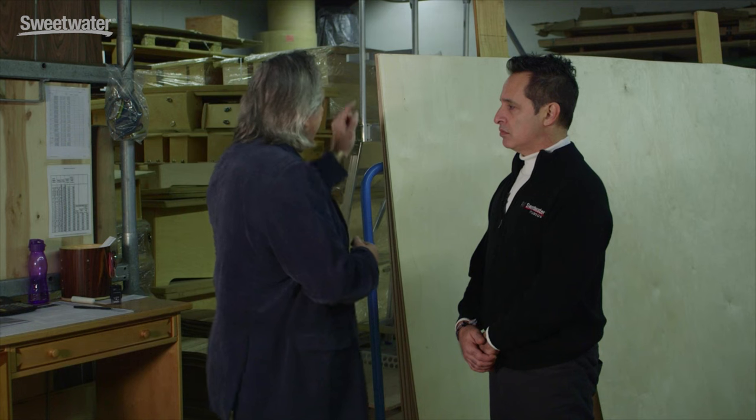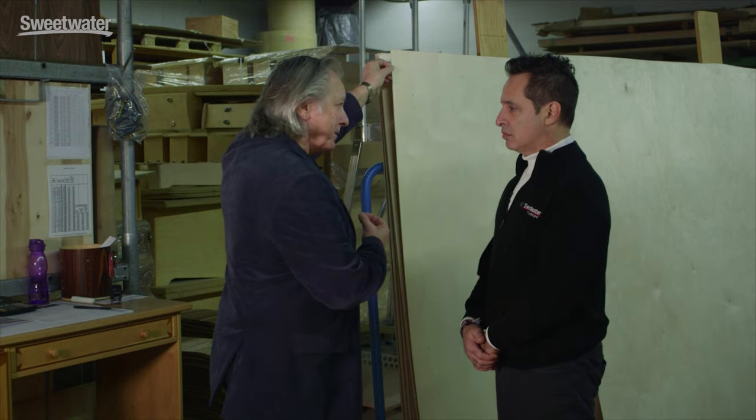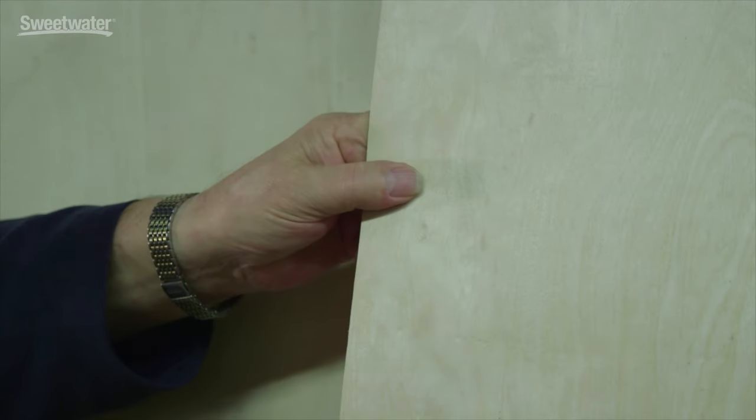We have all different kinds of veneers here — outside veneers, inside veneers. We have the SQ-1 series, the vintage series, the Prolite series, and the SQ-2. Today we want to focus on the SQ-1. This is the raw material, the plates for SQ-1 drum sets. We are using two different plates: a three-ply plate at three millimeters and a one-ply at one millimeter. In the SQ-1 series we have nine-ply shells on the bass drums and snare drums, and seven-ply shells at seven millimeters on tom-toms and floor-toms.